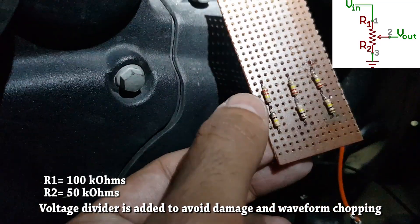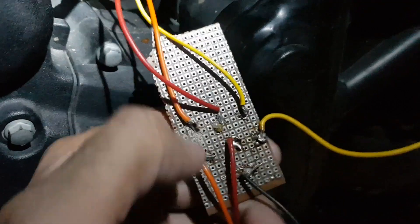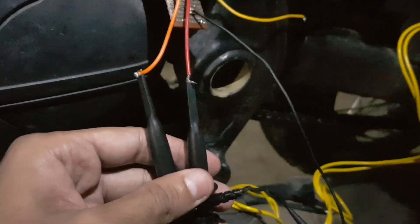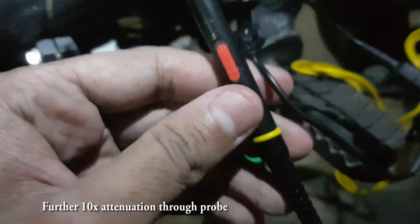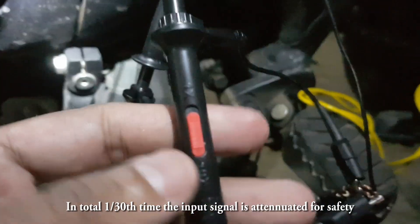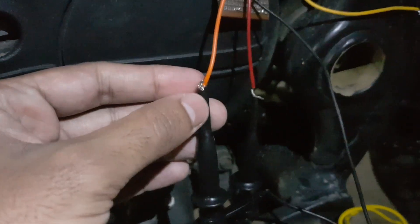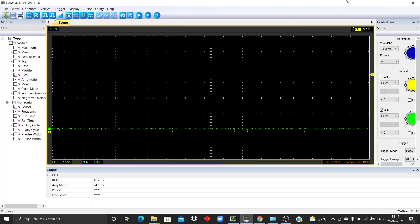I have made some changes to the circuit to avoid damage to the oscilloscope due to voltage surges. I have added a voltage divider circuit — this is a 1-to-3 divider circuit — and I am collecting the probe output between the three-phase alternator output and ground. This attenuates the signal by a 1-to-3 ratio, making it safer for the oscilloscope. For further safety, I have kept it at 10x mode: first a 1-to-3 attenuation, then a further 1-to-10 attenuation. We will now see the waveforms of 2 phases from the alternator.